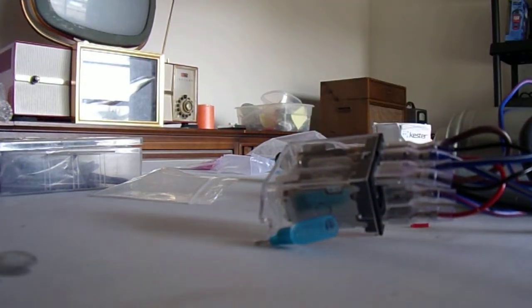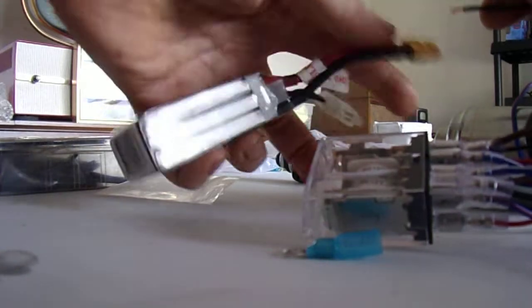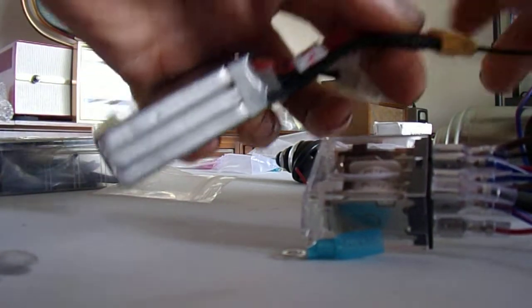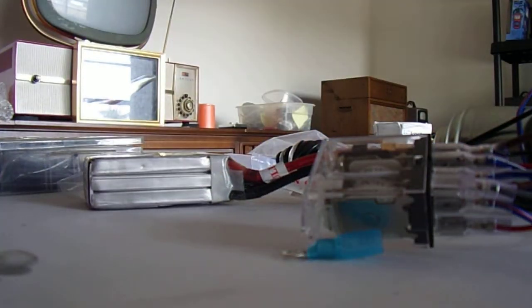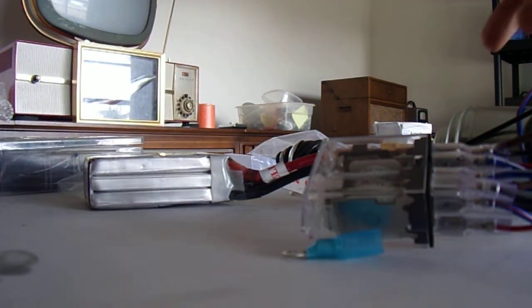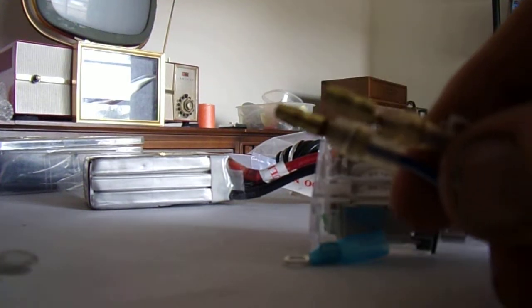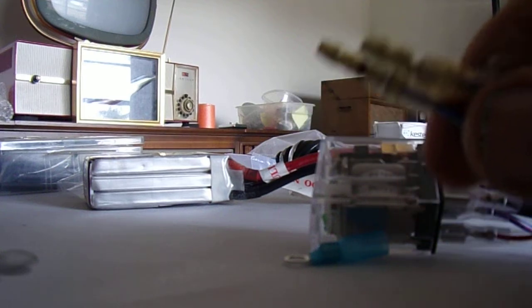There's a servo. So what I'm going to do now is take this battery and hook the ground wire, this black wire, into the black connection here. What I'll do when I'm ready to actually make this work is take that black wire and probably use one of these motor screws and ground it to the case, okay? Now here are your two signal wires that come from the single pole double throw switch that's built into the radio, up in the console.